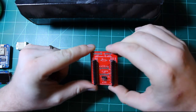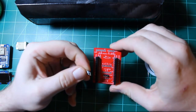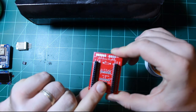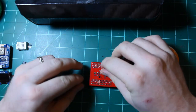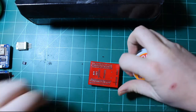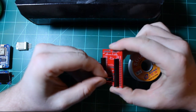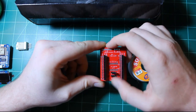And the header's on. Next, I'll put the second 3-pin header onto the EXT spot on the PCB. This is how external sensors will connect to the NodeMCU. Okay, next I'll slide this jumper switch onto the header, and in this case I'll just put it in the right hand side, so I'm selecting 3.3 volts for power to the sensor.